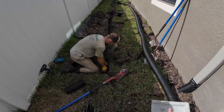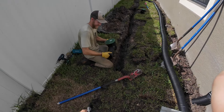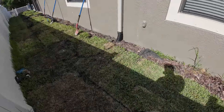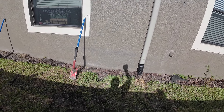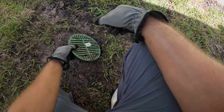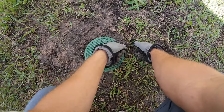So we're tapping the screw and continuing our way. Moving down this line — got that first catch basin in, sod back on top, downspout number one tied in. We like to put catch basins relatively close after we connect a downspout because over time roof granules and leaves are going to come into the downspouts and down this drain line. If you put a catch basin after that downspout, it gives you an access point to clean it out. Those roof granules will get stuck in the catch basin, so once a year you can actually maintain this system and it'll last you a lot longer.